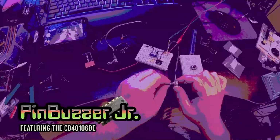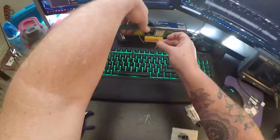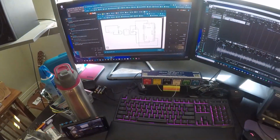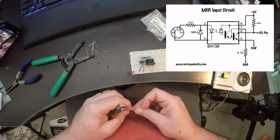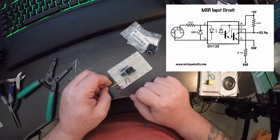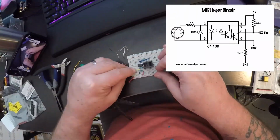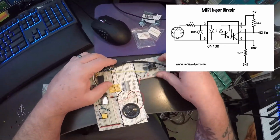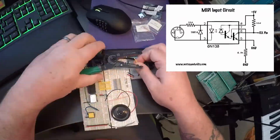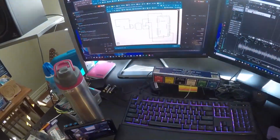That's my job, man. We're finishing wiring up the power to the optocoupler right now. We got a couple resistors leading away from the optocoupler as well, but the important part here is we're running power in, we're getting power from those two little wires that are dangling off the side there. Will eventually connect up with the bigger board. We're going to run one wire from pin 5, I believe it is, on the optocoupler over to, I'm sorry, pin 6 on the optocoupler over to the Cestino chip right there on pin 16. And that about does it. This thing is wired up. So now all we gotta do is wire it up to the keyboard, hopefully.